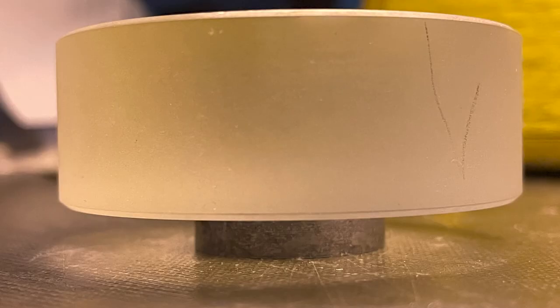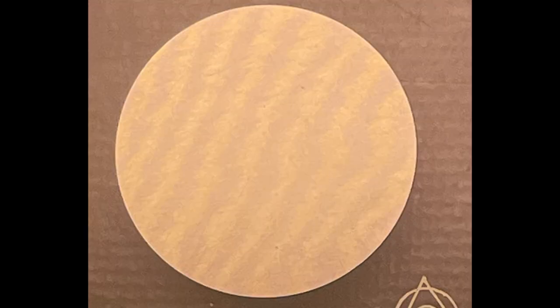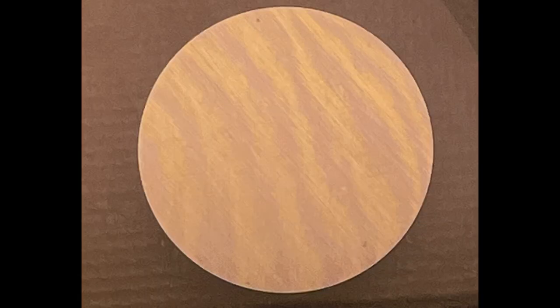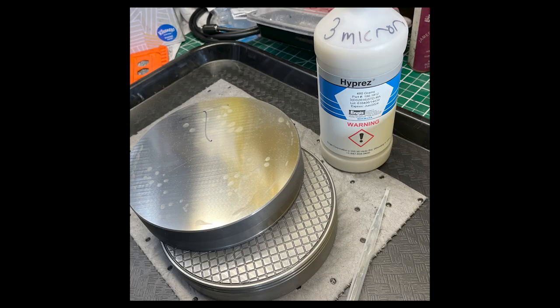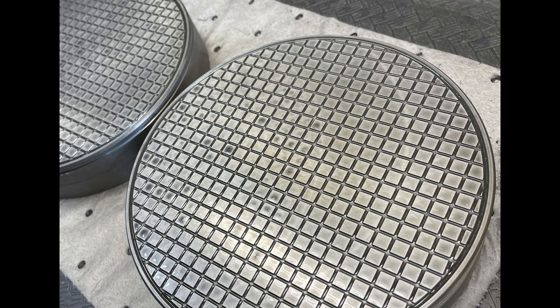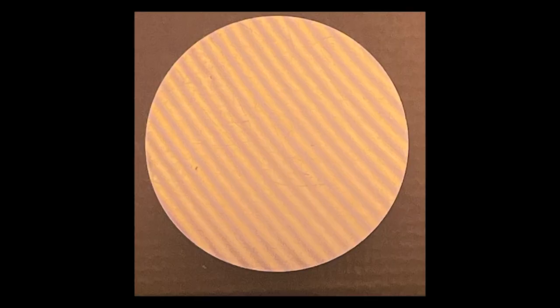This was the best I got, but it wasn't good enough. Finally, I decided I had to start using the round laps with diamond. I bought some brand new diamond from McMaster Carr — cracked open a brand new three micron diamond slurry. And that combined with the round laps started doing magic. Here we're just checking our optical flats to make sure everything is good, and you can see the lines are nice and straight. This is the best we were getting with aluminum oxide and why we switched — an indication of a convex surface. So this is when I decided we had to switch over to diamond. The eight micron diamond still started straightening out the lines and we started getting good results. And then we made the switch to three micron diamond slurry and the round laps, and things started working magnificently.